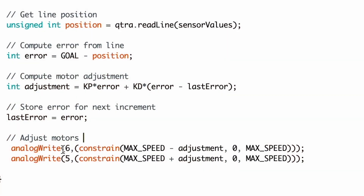To map the D term to motor speed, we add it to our formula: we multiply the KD term by the difference between the last error and the present error. The full formula looks like this: KP × error + KD × (error − last_error). This difference in error tells us how fast the robot is approaching its goal, so it can respond accordingly. I've created a small, easy-to-understand program to show how this works — let's have a look.